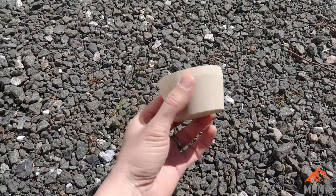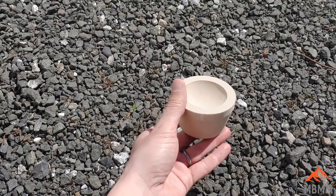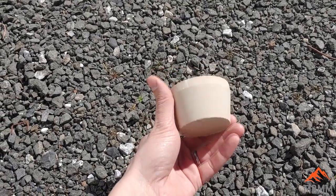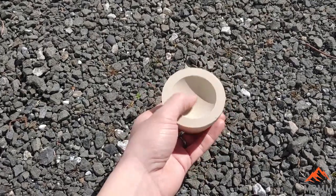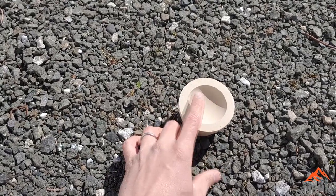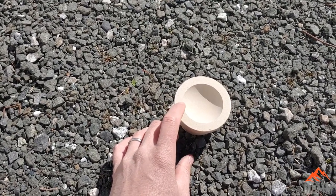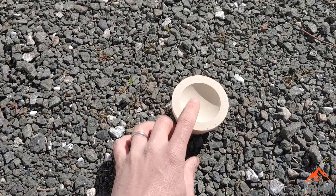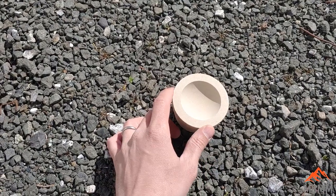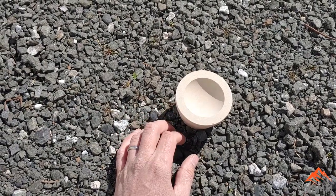So these guys here are the little cupels we're going to be using. These are pretty big cupels, actually. These can absorb, according to the manufacturer, over 300 grams of lead. I think it's like 350 or 380 grams of lead. They're made typically out of bone ash, and how these work is when the lead becomes molten and starts to oxidize on the top in the furnace, the bone ash cupels absorb the lead oxide like a sponge, but the metal stays down here in the very bottom, and so you're constantly shedding off the lead oxide into the cupel, and once all the lead is oxidized, you'll be left with a little tiny precious metal bead at the bottom.